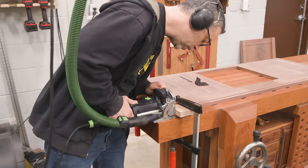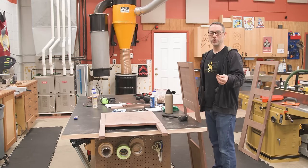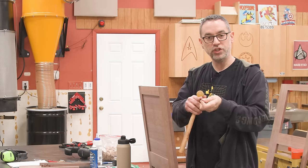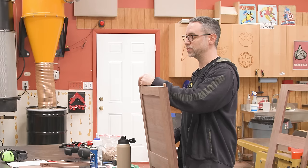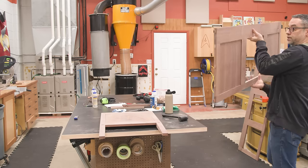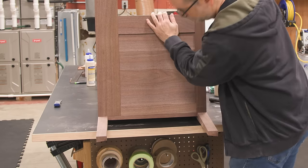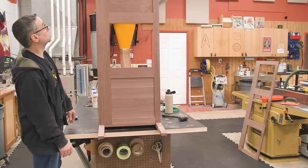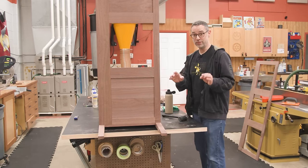Back to our larger bit. Now I think we should do a little proof of concept just to make sure everything fits the way we expect it to. A little tip: if you're doing a lot of domino work, it's a good idea to take a handful of each size and sand them lightly. They've got a little ridge on the end and a very rough surface — if you sand them lightly, you can have a much easier time with dry assemblies and not have to worry about yanking these guys back out of the holes. That's looking pretty good — no complaints. I think we can be confident the other side is also going to fit nicely.